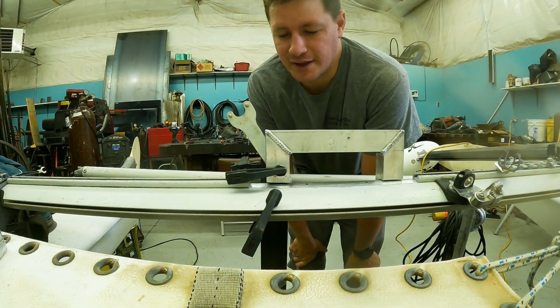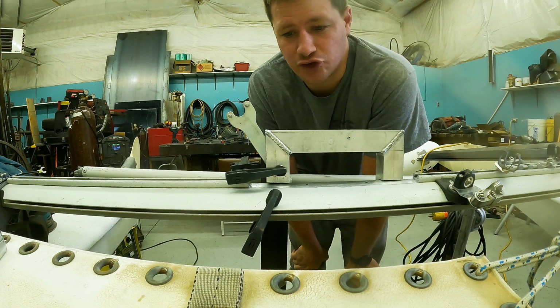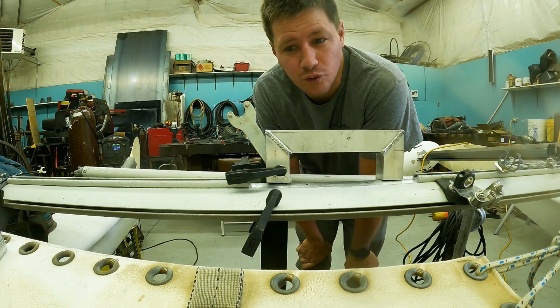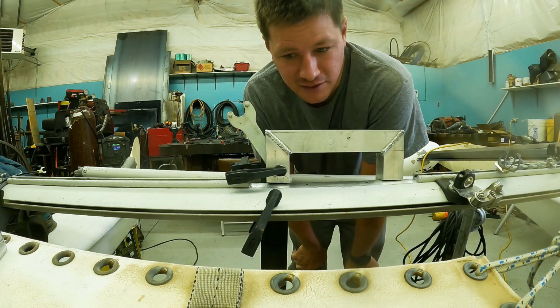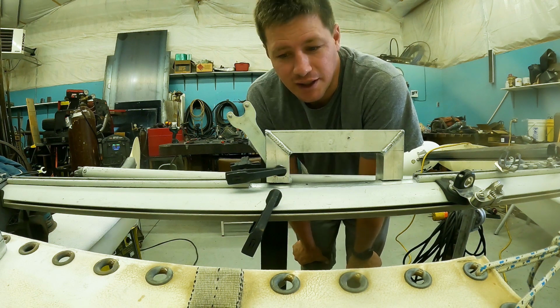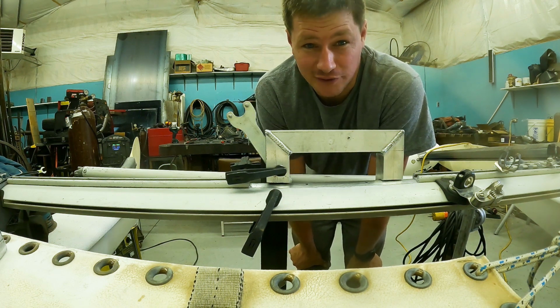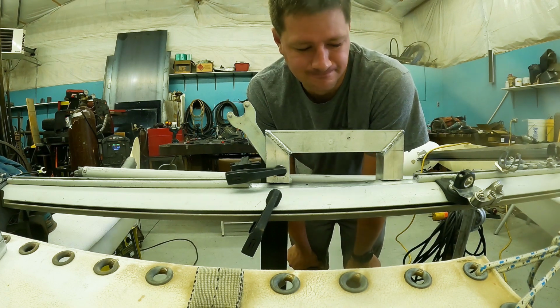Okay, the SQUAREWAVE TIG 275 is dead in the water. Looks like the control board died. I'm not getting any gate voltage for gates 3 and 4, so the SCR is not turned on, which means I'm not getting basically a ground. So yeah, that really sucks. Control board's $1,000. I paid $1,000 for the welder. I don't know that I want to spend that much to fix it.